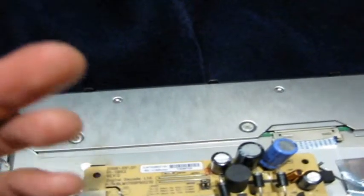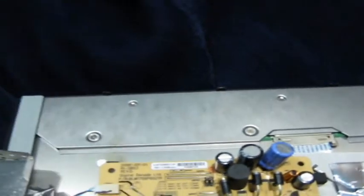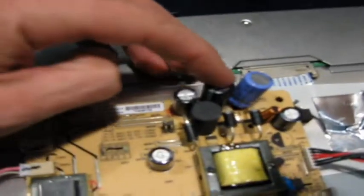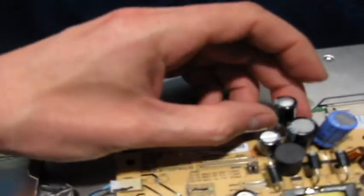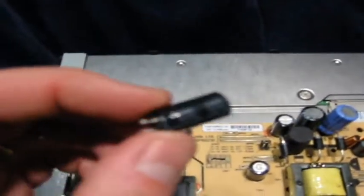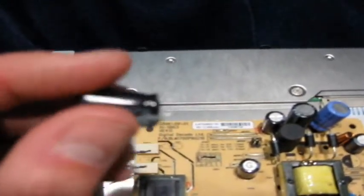What I've done was, because this was a 1000 microfarad at 16 volts, I only had two 470 microfarad capacitors, which are these two right here. This one here was originally over here, but there was an extra circuit board spot for a parallel capacitor.